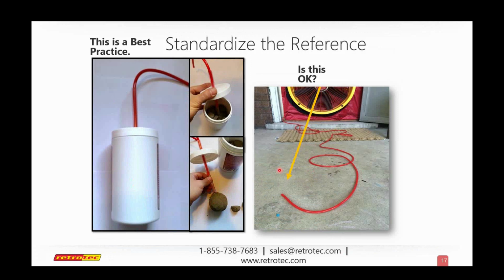In fact, there isn't. We make our ranges very, very close together so that there's a lot of overlap between gauges. Not all manufacturers do that. Most of them just have maybe a few percent overlap. We have like 60, 80% overlap. So you do have the ability to test an entire test in one range, which I think is a better idea. I would say for the kind of test that you're doing, if you tested from, let's say, 30 pascals to 60 pascals on a regular basis, if you're looking for results at 50, you would consistently get more repeatable results than testing from 10 to 100. So there's my point there.